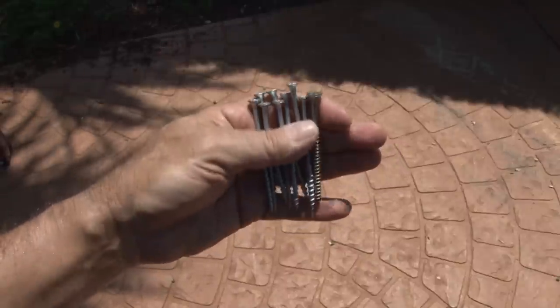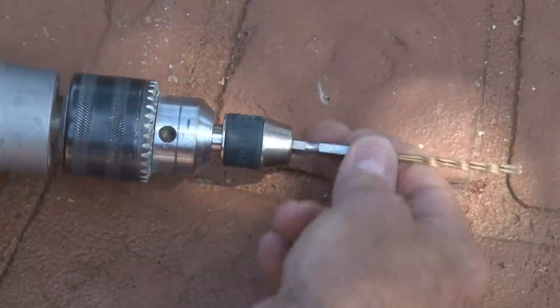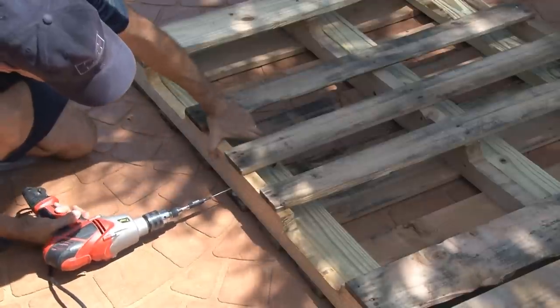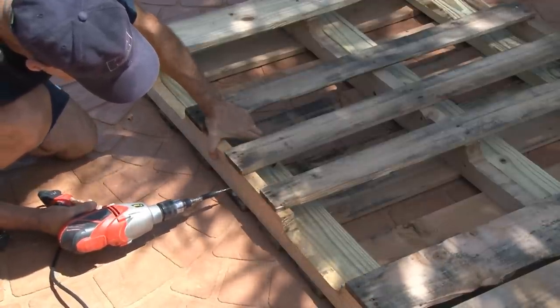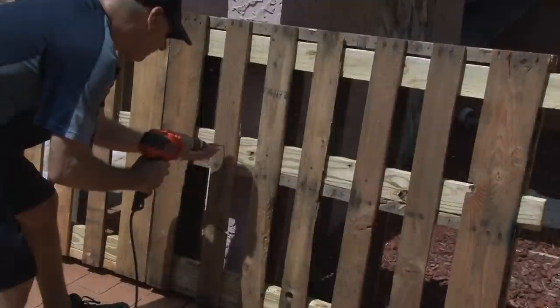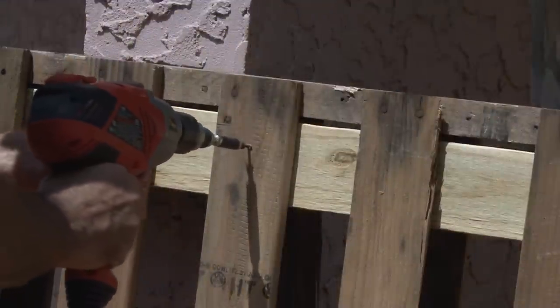They'll stick out a few inches at the head and the foot of the bed. I grabbed a handful of 3-inch plated and coated coarse deck screws for this next step. A pilot hole is always a good idea to prevent the wood from cracking, so I'll be drilling some holes before I put the screws to it. I drilled six pilot holes on each side and then put in six screws to tighten those 2x4s to the pallet. Now it's time for some 2-inch drywall screws — they'll do the trick for this next step. I ran a bunch of these screws through the pallet slats into the 2x4s and made sure everything was secure.